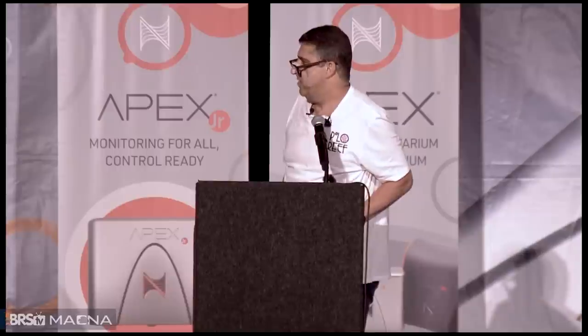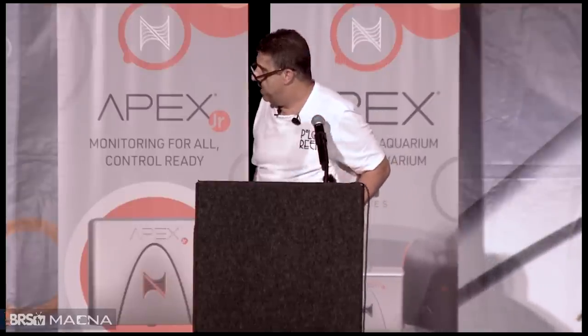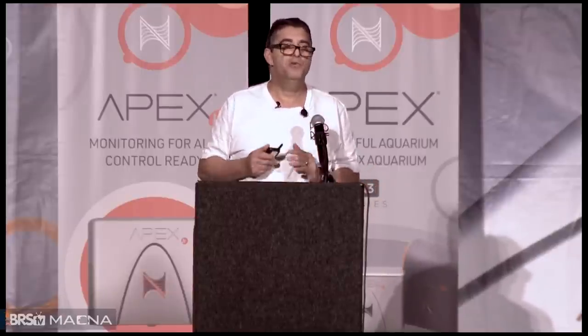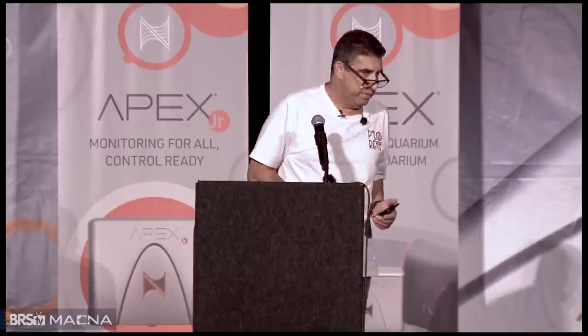We backwash the sand filter. If it's not weekly, it's once every 10 days, and we do it to keep the PSI down in the pressure on the sand filter and to keep that thing clean. And the other thing we did, mechanical, is we actually just used the pool filter. Let me just tell you what you can't do. You can't have 1,200 gallons per minute rushing on filter socks. Socks do not work in this tank. We tried it. The things just get pummeled. And so that didn't work.